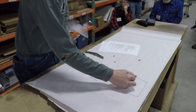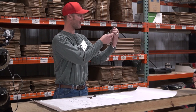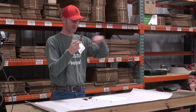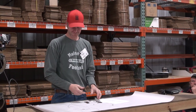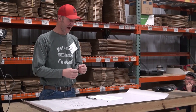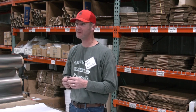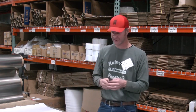scribe at the very face of this lock bar, right up against the very, very face of the lock face right here. Scribe across your blade. Then take your knife apart, and I grind my faces flat. Some guys do radiuses, some guys do 4-inch wheels, some guys use 2-inch wheels. I use a flat platen whenever I go to grind my lock face.